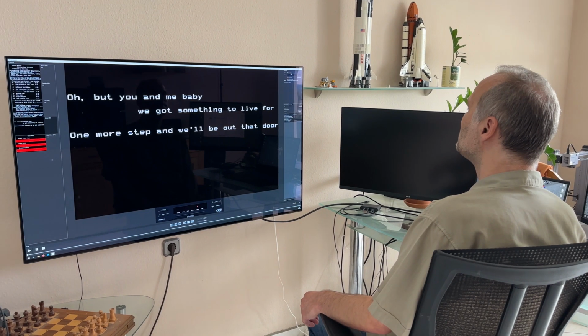When the audio boards arrived, it was clear that these additional pins, exactly 3 pins for the sub-channel information, were not led out on the board, and additional soldering was required. The problem was the pins are really tiny, only 0.6 millimeters. I tried to add a wire and solder it, but it was too hard for me, and I destroyed my first audio board.